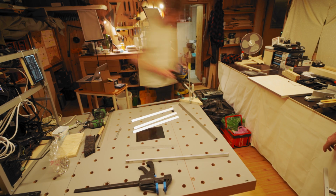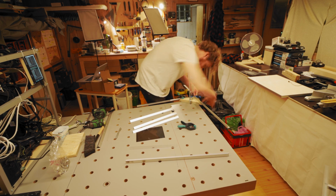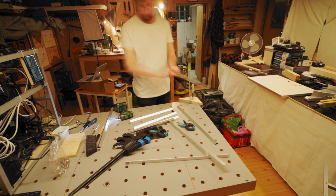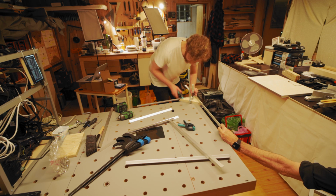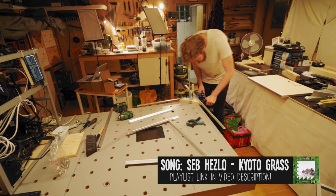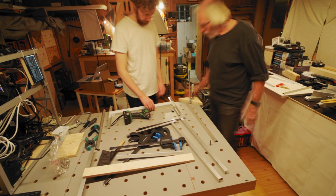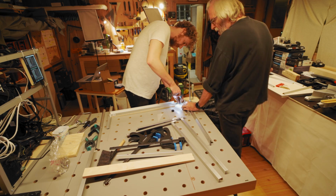And then what you gotta do is make the GPU shelves. You do that by screwing a 60 centimeter aluminum angle piece onto 2 40 centimeter aluminum angle pieces. The GPU shelf needs to be 3 centimeters in on the 40 centimeter pieces. I don't know how helpful it is just spitting numbers at you guys, but hopefully you can tell from the video what I'm doing here.